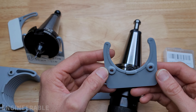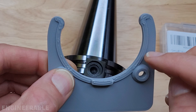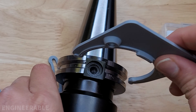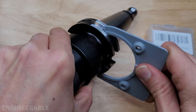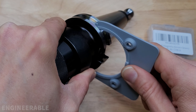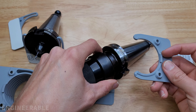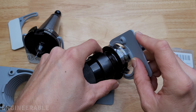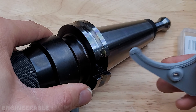This is kind of like the standard design for CAT40 tool tags, minus the magnet holes. They just have solid legs on the side, and what I discovered is that it's pretty tough to put these on and off — it takes more force than necessary. The diameter of this accounts for differences in the inner diameter of this groove, and that inner diameter is not consistent across tool holders; it varies a little bit.